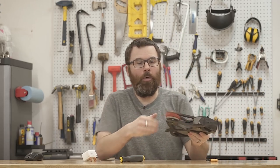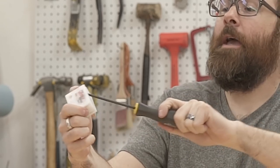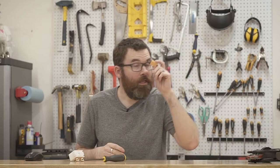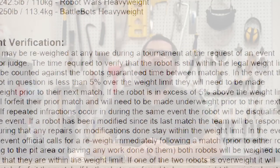Moving along to number two: safety. With both links and switches they're both pretty safe. Let's say you got this robot spinning out of control coming right at you. With the switch, you've gotta fiddle around, find the hole, and get it turned off — it works but it's kind of tricky. With a link, you just look at it wrong and it falls off and turns off. One little hit against another robot, boom — falls out. Definitely the link is the safest way to go.